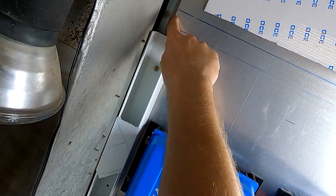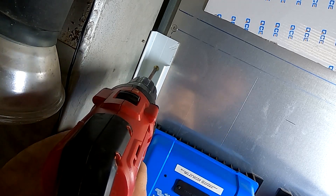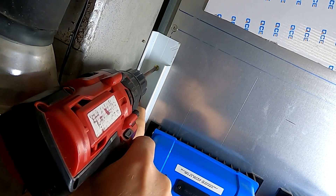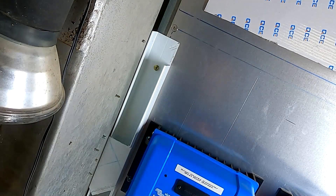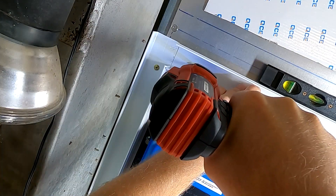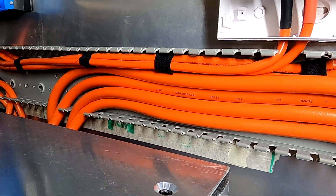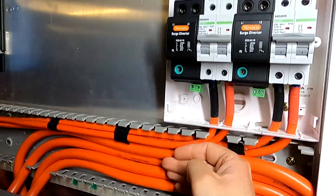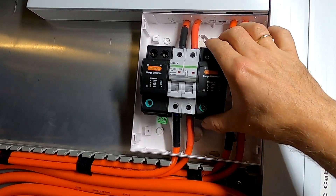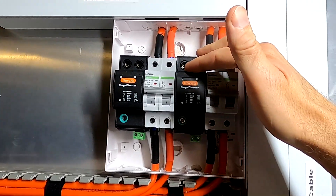It's double metal — there's the aluminium sheet and then there's the metal post underneath. I've just removed the lid here of this slotted duct and looking at the cabling situation here. I was thinking of removing the surge diverters, the surge protectors, in this switchboard here because they are not connected and I'm not sure if you actually use them.